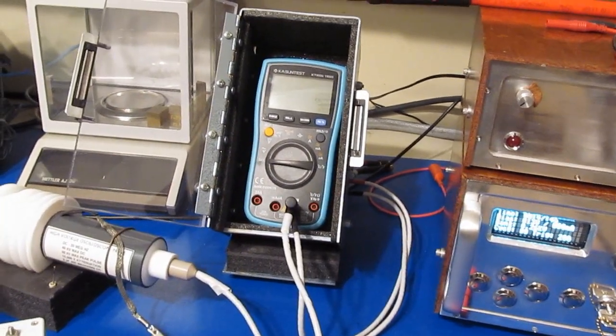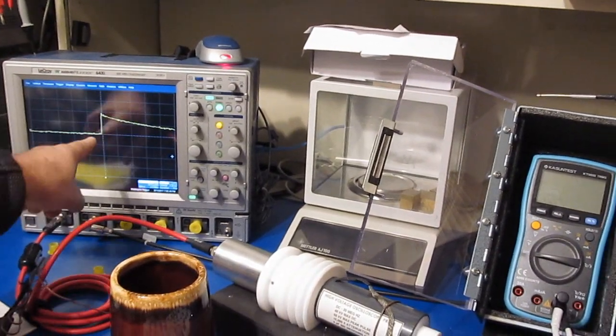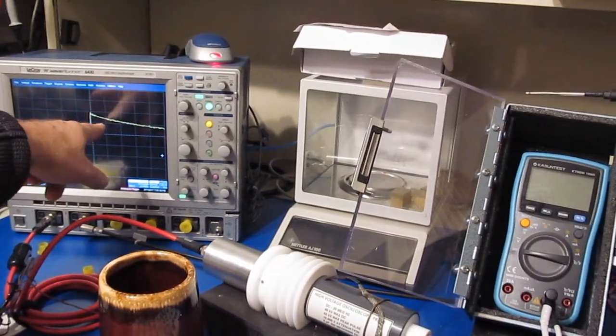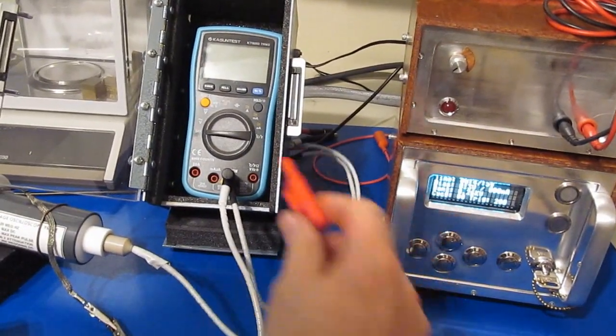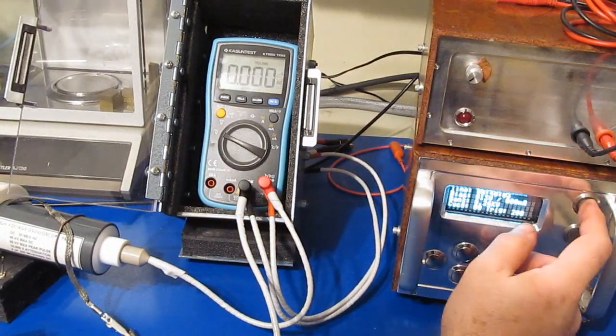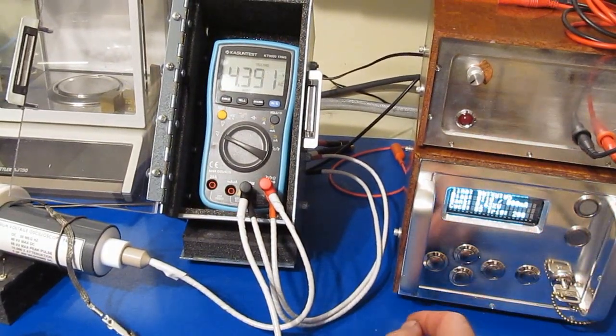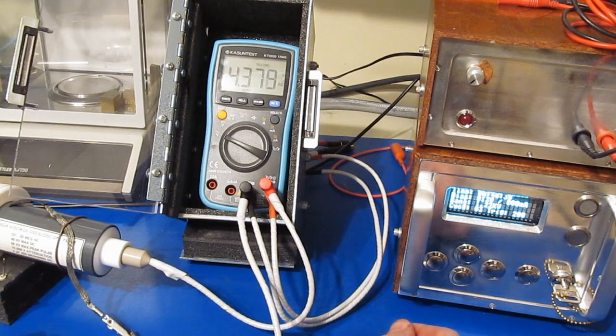Alright, it passes functional just fine. You can see I've got the generator reset. Scope is currently 2,000 volts per division, or 4,000 volts peak. Again, this will be 5 transients in each mode of the meter. 100 microsecond full width half height. 2 ohm source impedance. Oh, there it goes. Yep, so it's starting to break down.